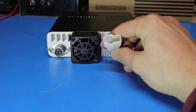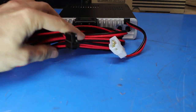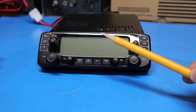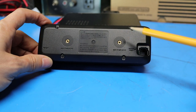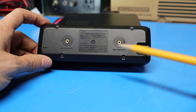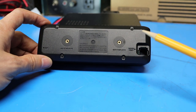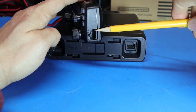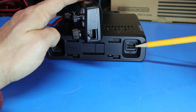The power cord pigtail comes standard with a T-style connector, and ICOM supplies a double fused power cord with a mating T connector. On the back of the control head there are two threaded brass inserts that accept metric 2.6 by 5 screws for the various optional mounting brackets. There's also the connection for the control cable to the radio body, and on the side of the control head is another microphone jack — so the microphone can be plugged into either the control head or the radio body.